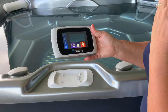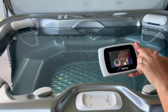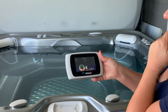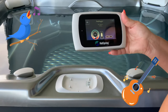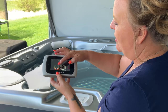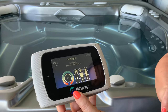We give it just a second to fire back up. Now it says the salt system is inactive — we're going to turn that cycle up and it's going to test. It takes just a second or two to get through its testing mode. Now everything's working great. I have a Grandee, so I'm going to turn mine up to a seven, and I'm actually going to hit my boost cycle because I'm a little behind on chlorine.